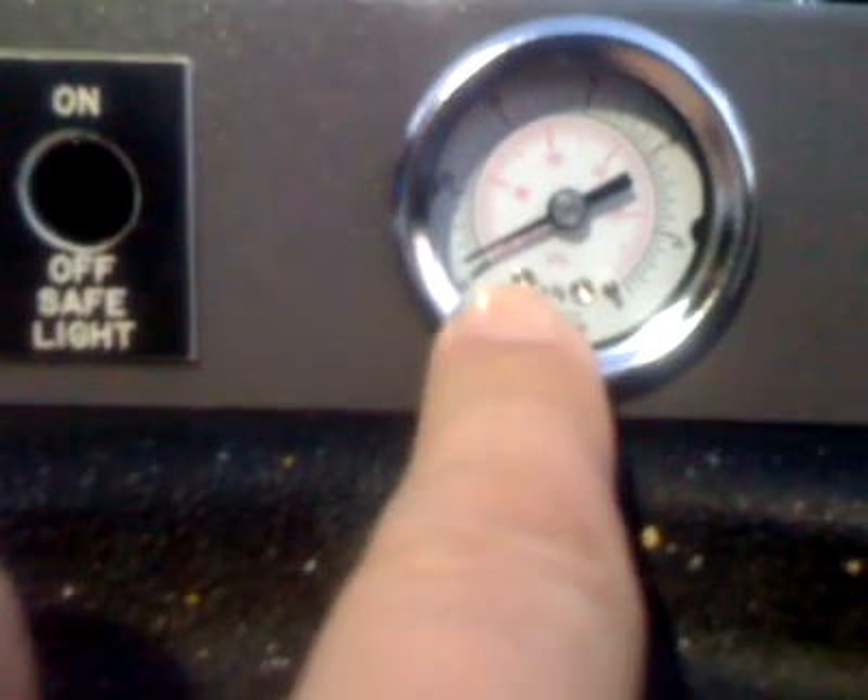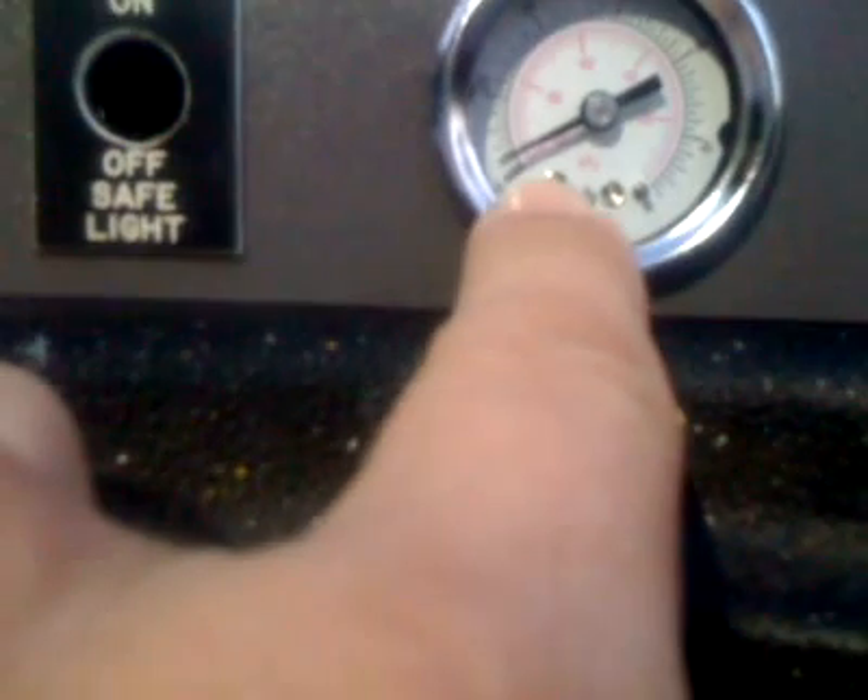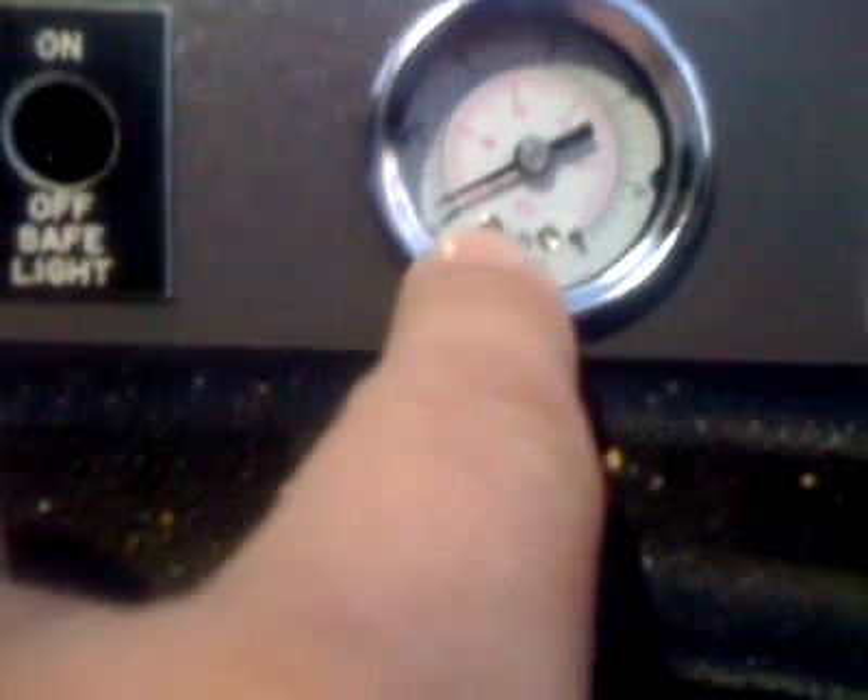So that's it. If I turn the compressor off and unplug it — there we go. You'll see that we're getting such a good seal that this is very happily holding a vacuum. That's just over 28 and a half inches mercury — actually very close to 29 inches mercury — which would explain why we've got quite a few bubbles there now. I doubt you can see that, but there are quite a few bubbles on the surface. It's not a hard boil, but it's certainly there, doing its thing.